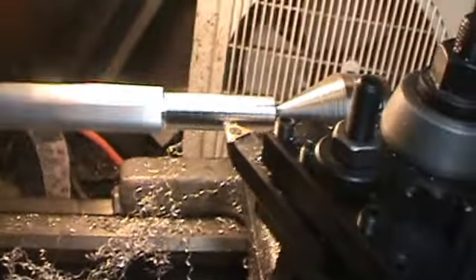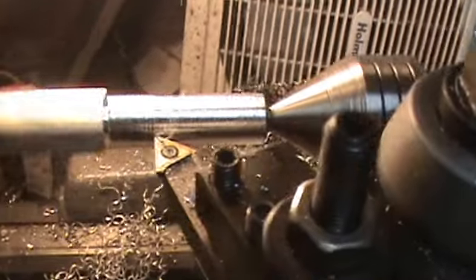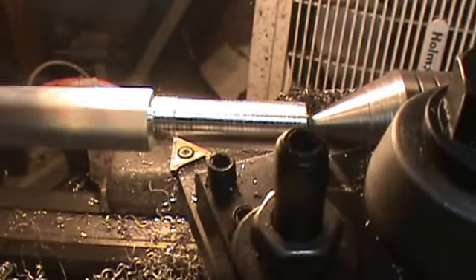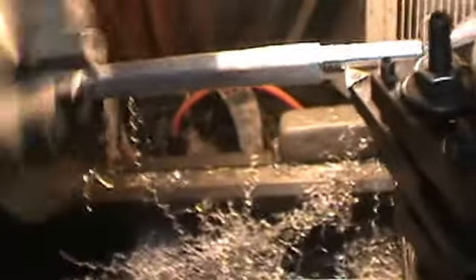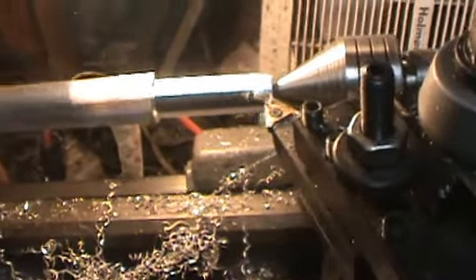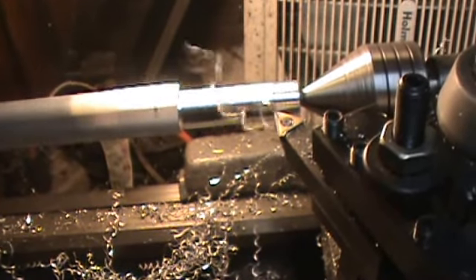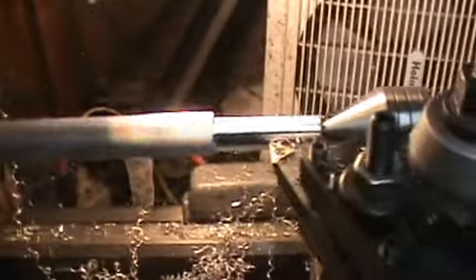By the way — I'll show you something here: we're halfway through. I'm at my fastest speed. I slowed it down to the slowest speed and you can see the difference in the quality of the cut. It's easy enough to use the gear box — wait until I pull this out and kill it. I'll go back to the faster speed and take another fifteen thousandths — thirty total. Cutting fifteen pretty good, strobing a little — basically because of that belt. I'll fix that.